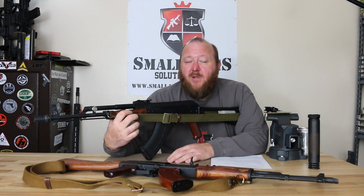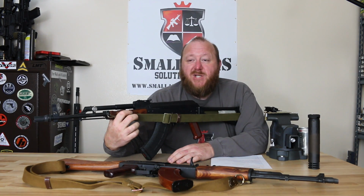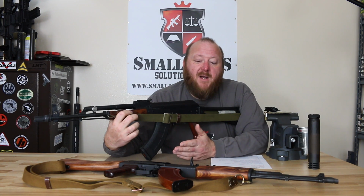So once you have your system tuned, you're using the exact same ammunition, because when you start going from round to round, you're going to see that difference in both chamber and port pressure. So if you change ammunition, you're going to need to change your gas ports, which you're going to see in the video. You're going to see where we set up the ammunition for the Russian, and we get it working perfect. And then we're going to put a lower powered type ammunition, the Gecko ammunition, where it has less pressure. You're going to see the gun's going to short stroke. We're going to have to readjust. So you see that as well. So there's a major benefit to having the system as long as your soldiers are aware how to use it.